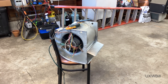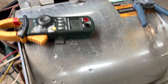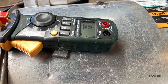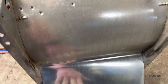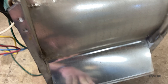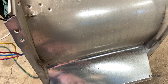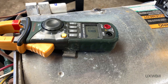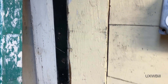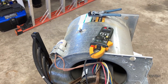This is really a pretty beefy motor for a residential furnace — it's three-quarter horsepower. We're allowed to draw 9.6 amps, so we're over-amping right now. Let's see if we can bring that down. Oh yeah, we definitely can. What I'm doing right now is dangerous because if this motor was not in electrically good condition, I've got no safety ground hooked up, so I would be the safety ground, which really would not be fun. I do not recommend that. We should probably have hooked that up. We're running at the highest possible speed right now. I'll let that off and it'll start over-amping again, so we better just go ahead and unplug it for now. That weak capacitor could also be a factor, although it definitely started and seemed to run okay for the most part.